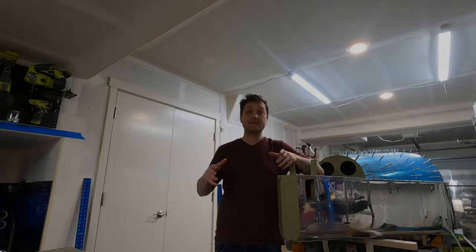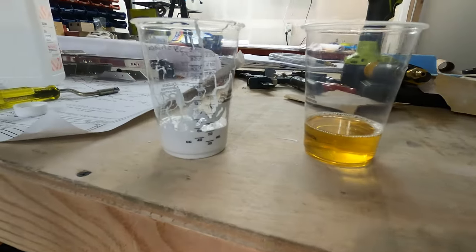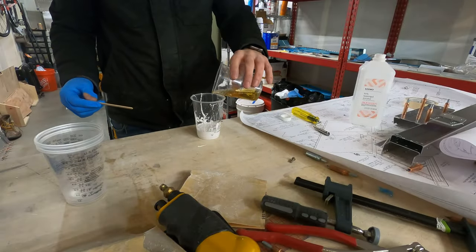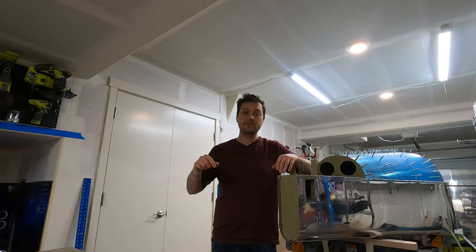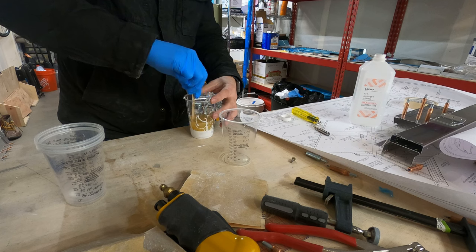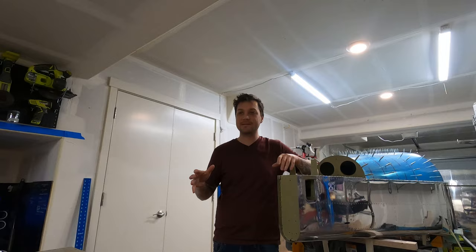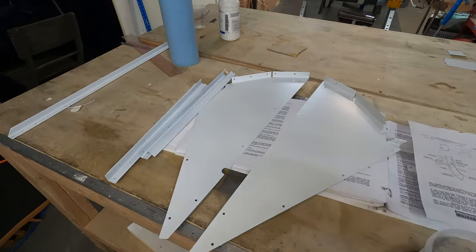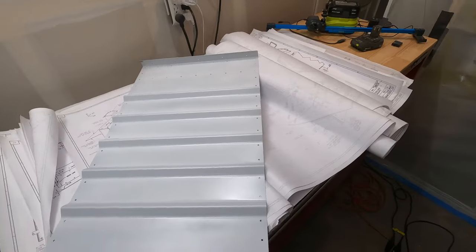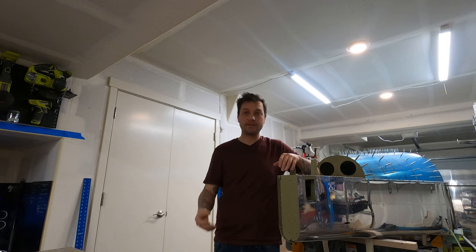I've been doing a massive amount of priming. I received a new can of my white primer. As I mentioned before, I think I messed up the chemistry of the old stuff by pouring off a can that wasn't fully mixed. And those suspicions were confirmed with this new can. The paint's flowing nicely. If I put enough on, I get a nice gloss finish. I'm still battling that line between a nice light coat, but enough to get a really good covered coat that doesn't leave any of the blueness of the metal and will allow it to gloss out.